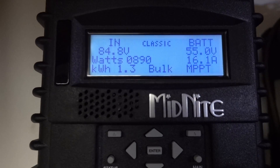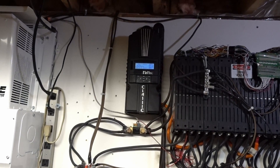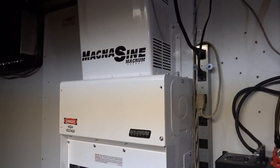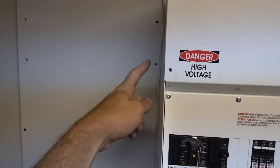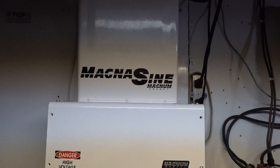I've got a little bit of power coming in and batteries are low. My full voltage is 66 volts, my cutoff voltage is around 50 volts, and I'm at 55 volts. The reliable inverter is doing amazing, and I've been using it on and off. I actually disconnected the little extension cords I had coming out — I'm gonna hardwire this thing soon.